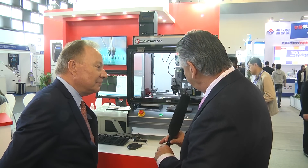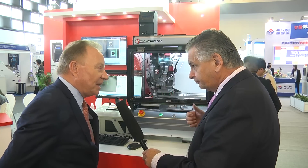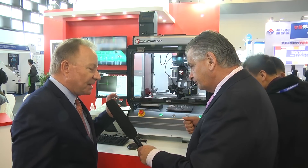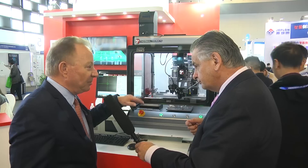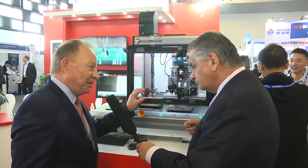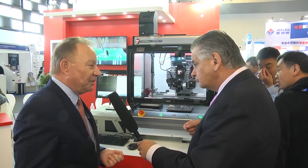The robot is completely built by Thermaltronics. It uses a range of standard tips, slightly modified in that the collar of the tip is different, but price-wise it's very competitive. When you load the tips into the system, it moves to a calibration point at the back of the system, which calibrates every tip before it goes into use — because each tip can have a minute difference depending on the amount of tin on the tip. So it's very important to pre-calibrate before you start soldering.